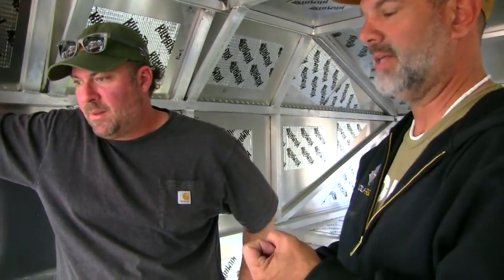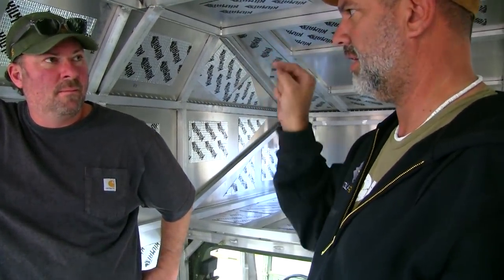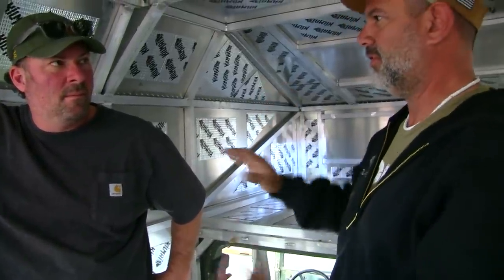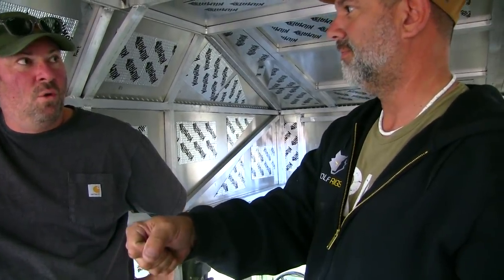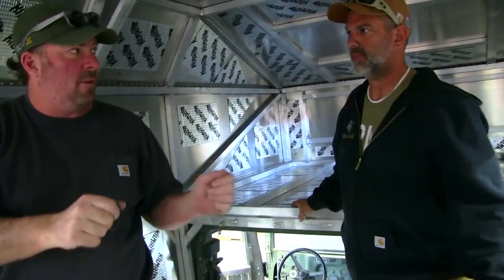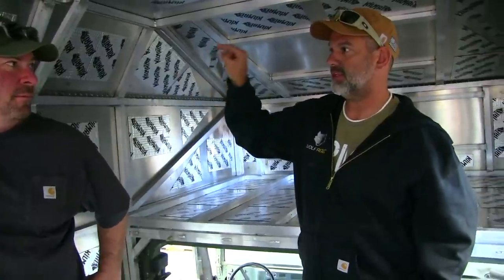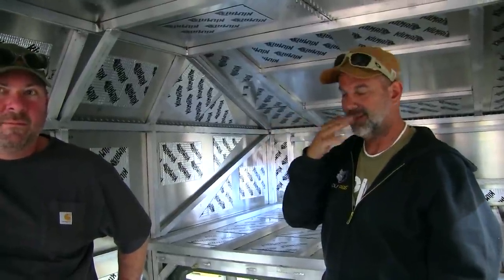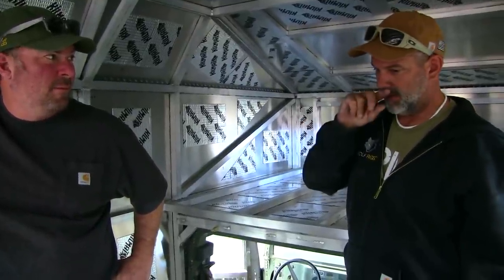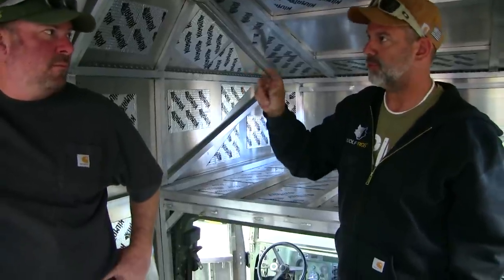We're going to have a dial for the Webasto heater, and actually the water heater control needs to be over here by the shower. Have you seen our water heater and how you adjust it up and down? So when you're going to take a shower, you just turn on the hot water — you don't ever use cold water in the shower. You literally don't have to have a cold water nozzle in the shower if you don't want to. You definitely don't want one that has anti-scald. I was going to do two separate individual levers, old school style. That would be the best way, because if you have the anti-scald it messes with the flow. You just set the temperature for the shower you want on the dial — we have it usually at 102, 103, 104. And we also need a pressure adjustment regulator, which lets us adjust the amount of pressure. We're probably going to have a 50 psi water pump in here — we'll want to turn that down to about 30.